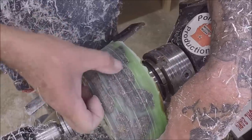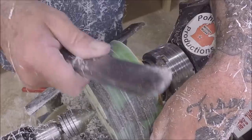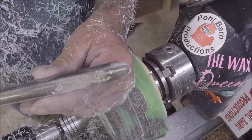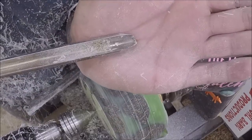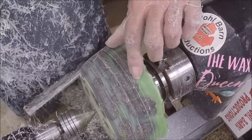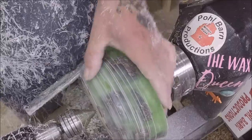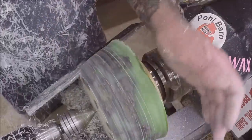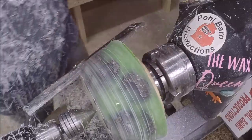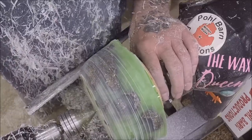For the most part it's pretty solid. I've got a couple little air holes in it. The other problem I'm having is I'm throwing sparks - I'm not sure if it could be the glow-in-the-dark stuff, but it's doing a job on ruining the edges on everything. Even my bowl gouge - I get it sharp and it just flattened the end of it right off. So I'm just going to keep using the scraper and try to get this smoothed out, maybe a little bit of CA glue. It's pretty hard actually. I'm pretty impressed, other than a couple little voids. I'm going to try to get this straightened out, get these filled in, sand it down, and then cut the mortise in the bottom. I'm hoping Richard isn't having this problem, because I hope it's that glow-in-the-dark stuff which I didn't do too much of in his.